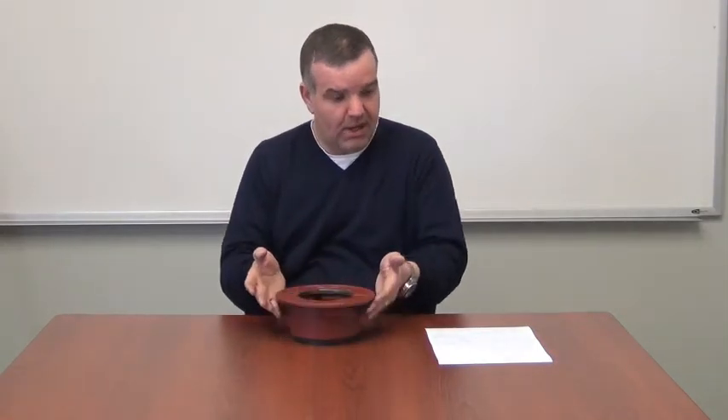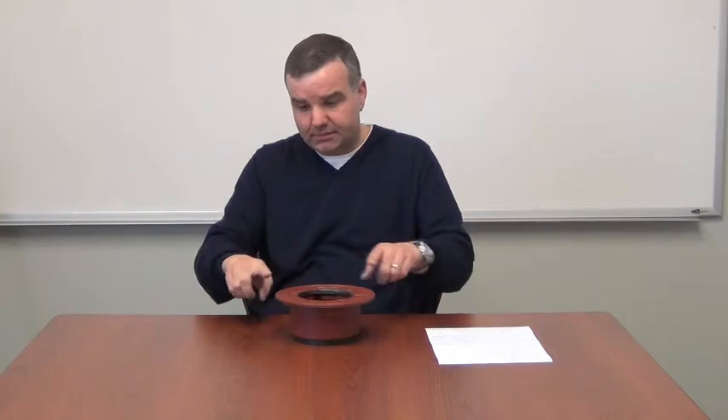The height is a big advantage versus others in the market. The vertical height from here to the ground is roughly one inch less than others out there. We made it one inch less because contractors told us the shallower we can make this body, the easier it is to use in shallow pour applications — there's less need to build up the floor to get the right pitch.